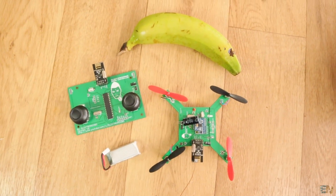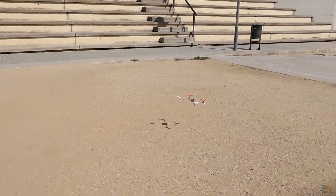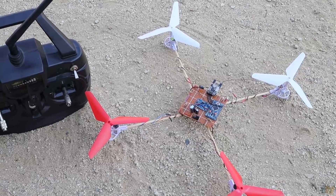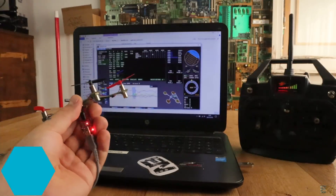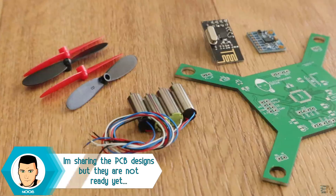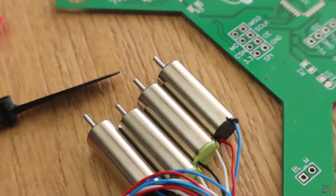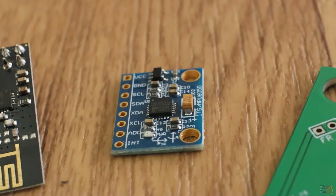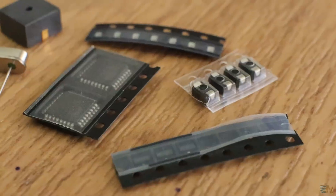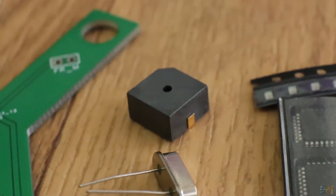What's up my friends, welcome back. First of all, you have a full guide, the schematics, final code, and all that you need to build this project below in the description. This brushed motors drone finally works and I'm more than happy about that. But today we will build this version which still has some errors and I'll definitely post a future improved version. So I start by gathering all the components: the PCB I've created, 4 brushed coreless very small motors, the MPU6050 IMU, the NRF24 radio module, transistors, diodes, a 16MHz crystal, a small 3.7V battery, a buzzer, and plastic propellers.